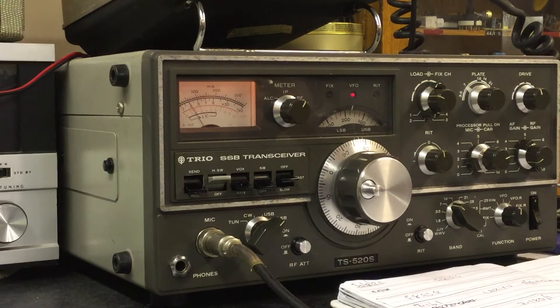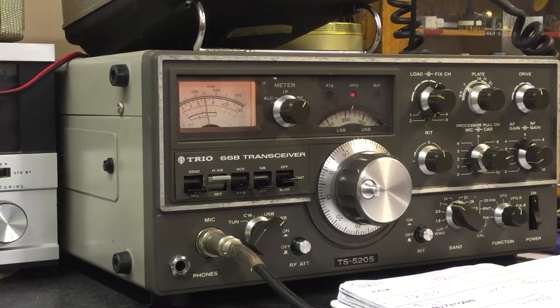Oscar Echo 5, Sierra Lima November mobile — this is M0 Juliet Charlie Foxtrot coming back to you. Absolutely superb. The homebrew antenna is actually working very, very well. You do have 400 watts though, and I see that you're near the city of Linz, L-I-N-Z. No problem whatsoever copying you. You're 5 and 9 plus 10, but with QSB it does drop you towards my very high noise floor. My noise floor is around S7 to S8 today on 40 metres, and sometimes you drop towards that. But otherwise I've got no problems copying you — though if it went much lower, you would become readability 4.